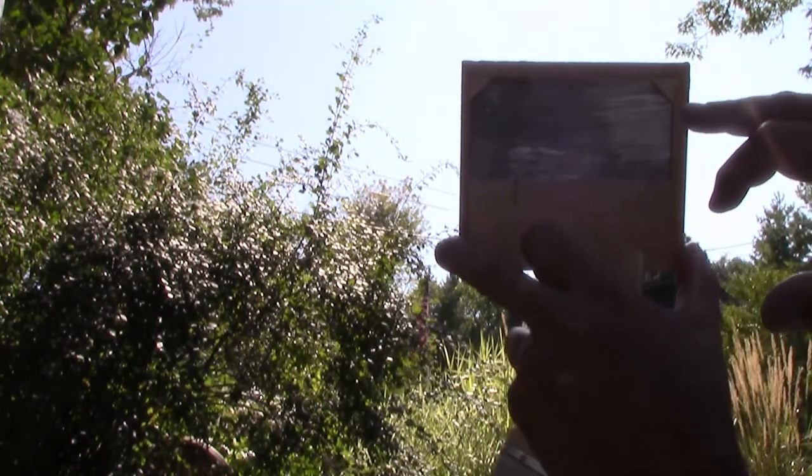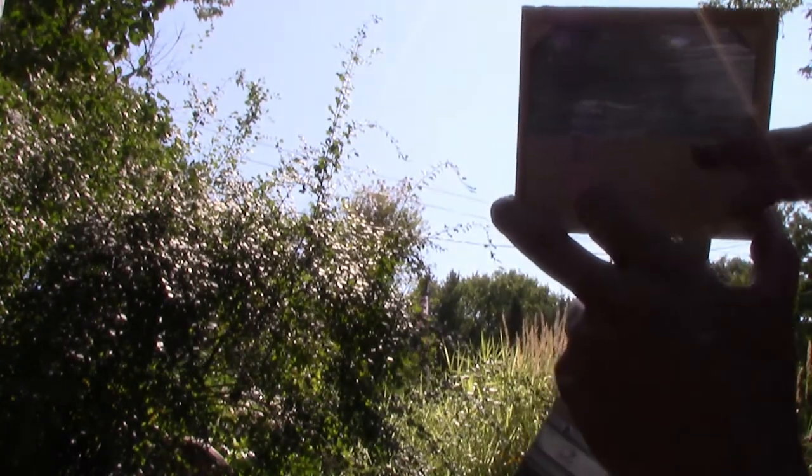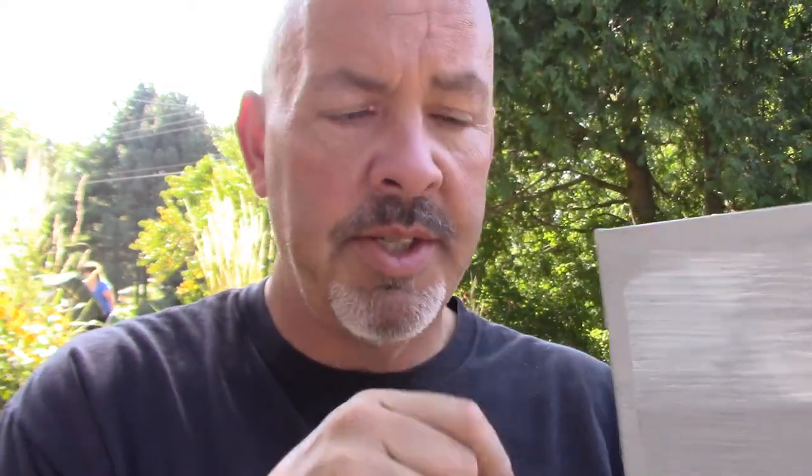So, hey, it's just a test piece. And this is why we have our little practice session to make sure that we don't make the same mistake when we're doing the plane. So now I know when I'm doing the plane, this will be thinner than it is. I'd rather have to put two coats of this on real thin. I think that little dab of aluminum paste I put in was just too big, and it thickened it up too much. So we'll get this all prepped, and then I'll do a test paint on it, and we'll see how it looks when it's done.